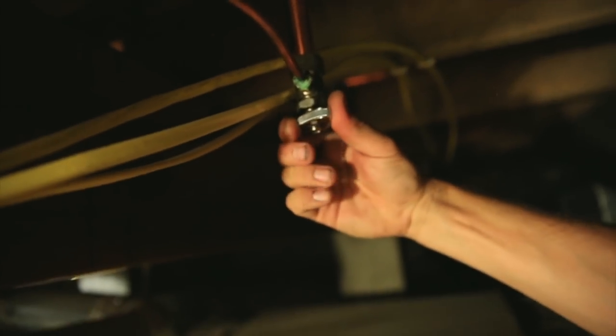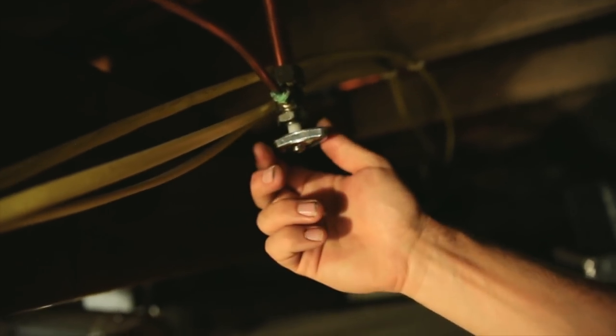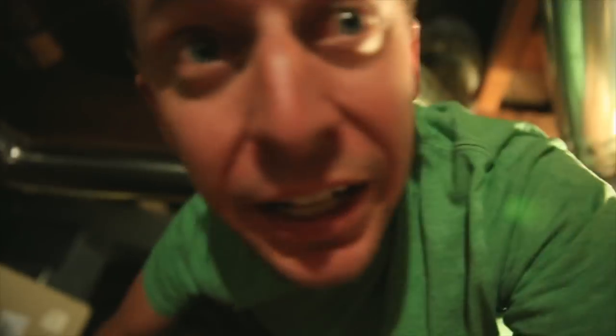We are now under the house, getting real close. You've got to find — I don't know where yours is — maybe it's in your garage. I'm down in my crawl space. You've got to find the place to turn the water on that feeds up to the swamp cooler. Then you've got to go up as quick as possible back to the roof and make sure the bobber is working so it turns off and doesn't overflow.